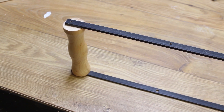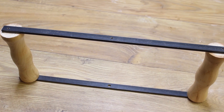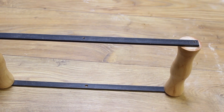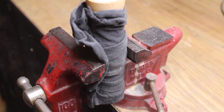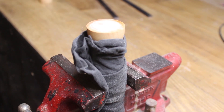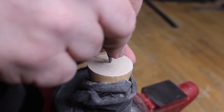So here are the four pieces I've made so far. Hopefully you can see from this how it's meant to go together. Up until this point the project had been going fairly smoothly. I decided I wanted to recess the bars into the handles and then cap them so as to give a cleaner finish. So I wrapped the first one in a rag and clamped it in my vise. I used a scribe to mark the centre and then, having drilled a hole in the end of each bar, drew round the bar stock.